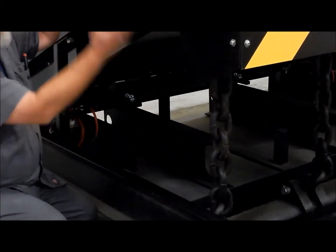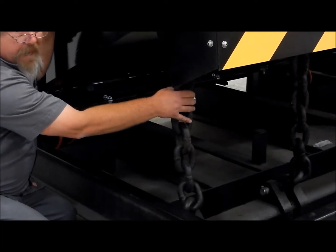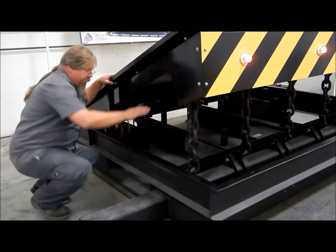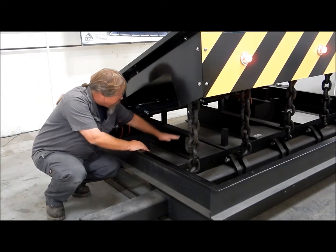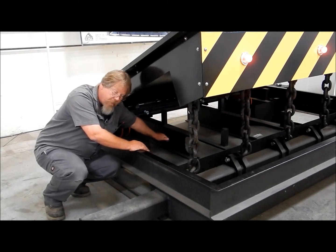The chains are key to the stopping power of this barrier. They prevent the barrier from lifting over, and they help to trap the vehicle when the vehicle impacts these chains — it will pull the top plate down. The framework of this is always concreted in, and the intersection here, which is hollow because this is our demonstration unit, is also filled with concrete and rebar.